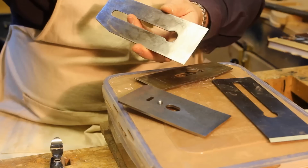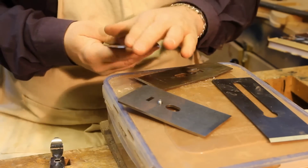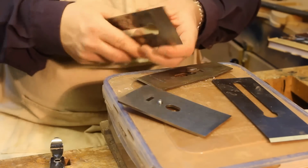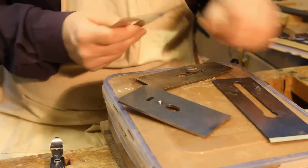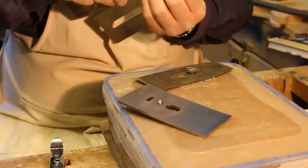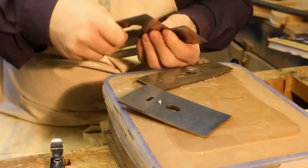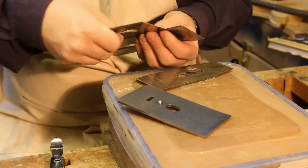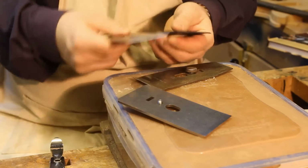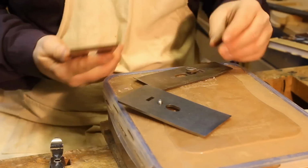Obviously, well, not so obviously actually, when you're sharpening a plane blade, you have to have a mirror surface on both sides. Leaving one side rough, you will never ever get a sharp edge. So that is important to know. Check out our sharpening videos. The Hock blade is about 3/4 of a millimeter just by eye thicker than the original one, and the angle is a little bit less acute than what I normally have, but that's not a problem.